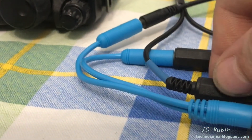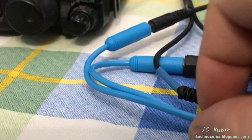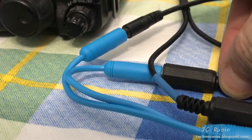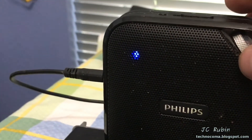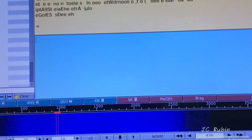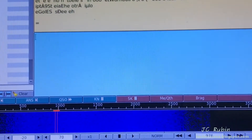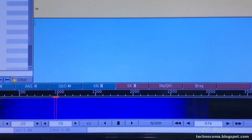I've set up that scenario. The microphone cable is plugged directly in, and the output going out from the computer is plugged into this cable — one going to the radio as before, and also splitting off to another wire. That wire wraps around back and goes to the speaker, which I can control the volume of independently. So when I transmit out of FL Digi to the radio, I'll be able to hear what I'm transmitting. There is a lot of value in hearing the transmitted digital signal, and this way we're allowed to do that.